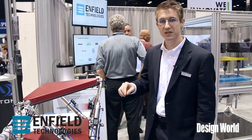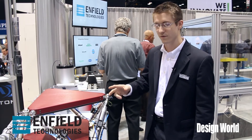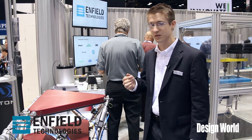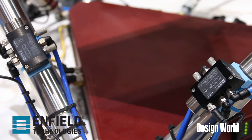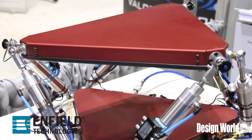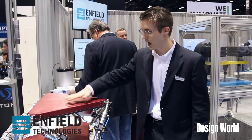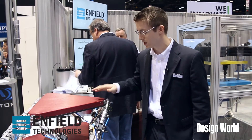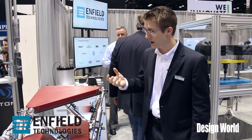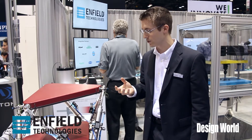This type of setup is commonly seen in six-degree-of-freedom systems, and also in three-degree-of-freedom systems, which is probably the more common implementation when being used for leveling systems. What we're doing here, and what we typically use this for in industry, is when you have parts coming out of a machine, being able to automatically level what's going on. As parts come in and are distributed throughout the system, we pay attention to the position feedback on each axis, and by doing that we're able to adjust one or more of the cylinders to make sure the system stays level.